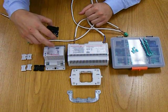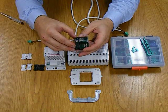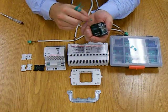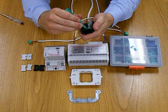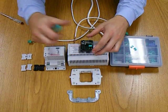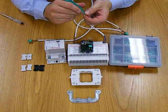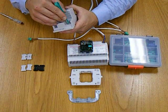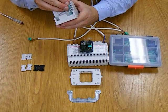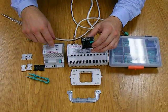Now, to get this switch communicating to this dimmer is very simple. On the back of this switch there is area point of light and area point of light. So if we use these little green configurators and we put area 1 point of light 1 into the housing, and in the dimmer we put the identical configuration — so area 1 equals 1 and point of light 1 equals 1 — we now have an association of this switch to this dimmer by way of what is called point-to-point lighting association.